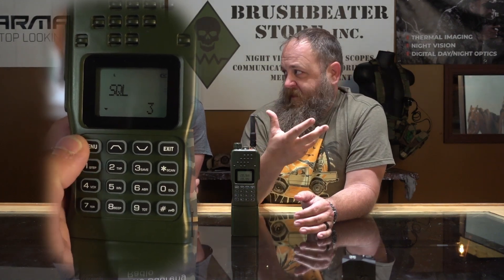Menu number zero is going to be your squelch setting. Squelch is a filter that filters out unwanted static — the sound threshold of when this radio receives a strong enough signal to activate the speaker. If the signal is below that noise floor, you won't hear it. I always set that squelch setting to three. You can monkey with those settings in software like Chirp, but I don't recommend doing that.